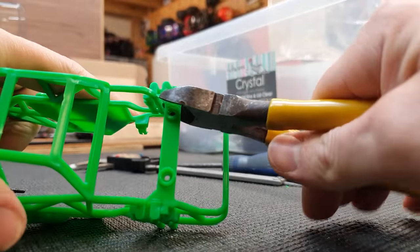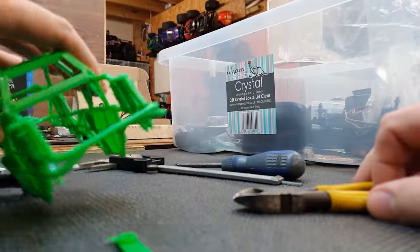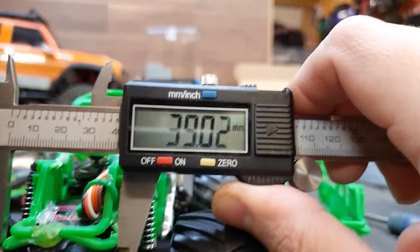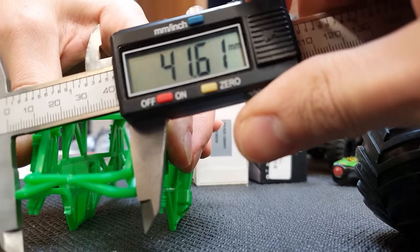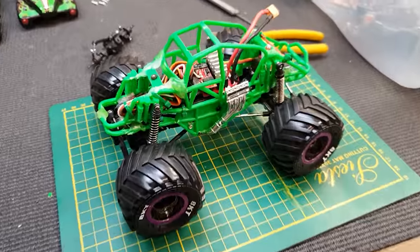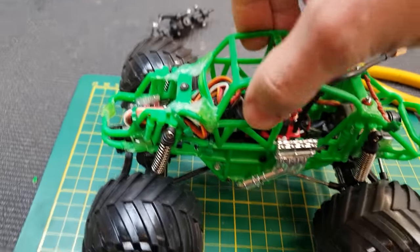You want to cut here as close to the outside as you can — same on that side. We're going to be using this piece again later on, so don't go losing it. On the nose, if you cut just after where these two tubes meet on both sides, you want to be looking at around about 39mm from outer rail to outer rail. With it pushed together it's a tiny bit more, but we can adjust that later. It's always better to leave it a little bit long so you can cut more off. If you cut too much off it's going to make it more difficult. Now, I glued everything together on this one with hot glue and a few people said it looks a little bit messy — and yes, I agree, but it does get the job done.